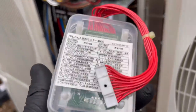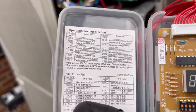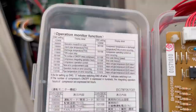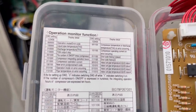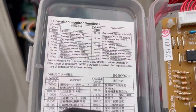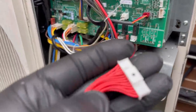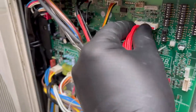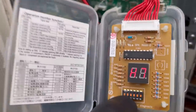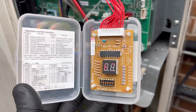I did forget to mention while diagnosing the fault — these things are quite handy. When you do the Mr Slim course, you'll get one of these from Mitsubishi. Although they don't tell you a huge amount, they do tell you some stuff that can come in handy when diagnosing a fault — compressor temperature, discharge temperature on error occurring, error history, compressor operating hours, currents, liquid and discharge temperature. That plug just plugs in here and then you flick the dip switches into the appropriate positions and it gives you a reading on the display.